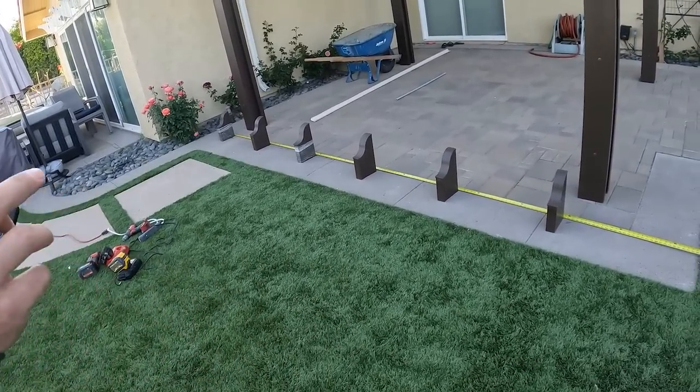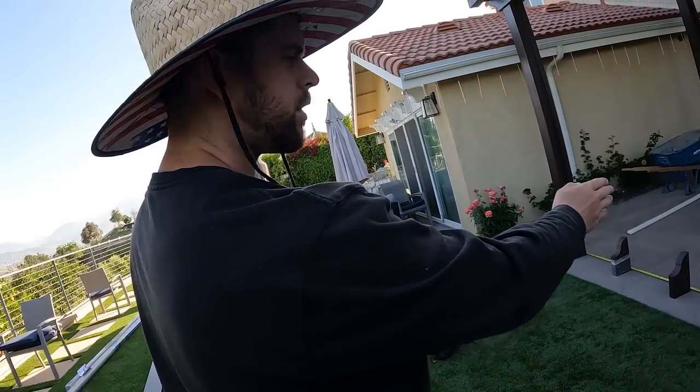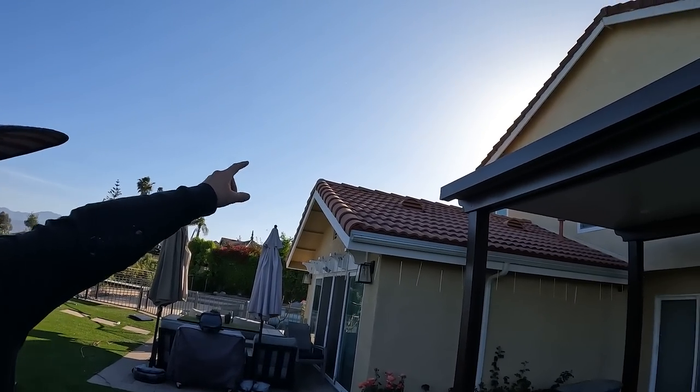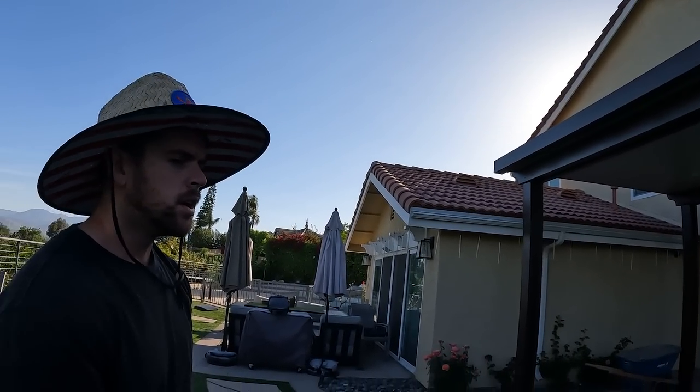2 feet 4 inches space gap counted for. And then every other rafter tail after that will be spaced at 2 feet 4 inches, and that will give us everything properly divided up by 2 feet 4 inches, and everything will look good. So what we're gonna do is get our side fascia up first, and then we're gonna go ahead and get all the rafter tails installed. Hopefully that makes sense. If not, go ahead and comment, or if you got a better method, let me know.